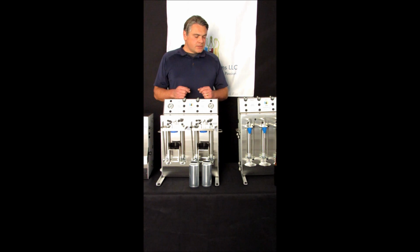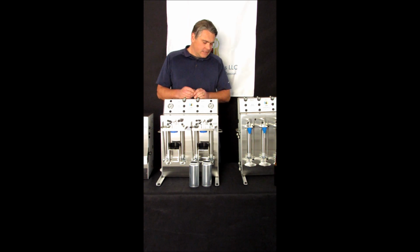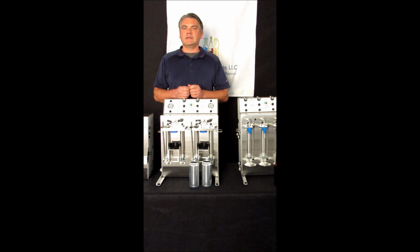On our counter pressure fillers, you need to have some things on site to start a successful fill. One is CO2 for the purge. You also need a source of compressed air. You can use any standard air compressor you can get in retail for about $100. And obviously your product. So the inlet of the machine is a 3/8 and we're provided with an adapter to a 3/8 barbed fitting. So whatever you need between your tank, your tri-clamp, your keg is also something you can provide.